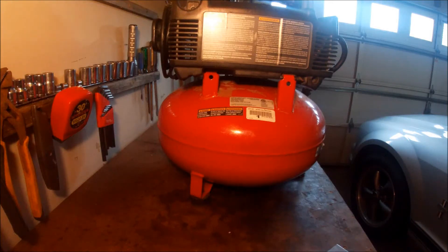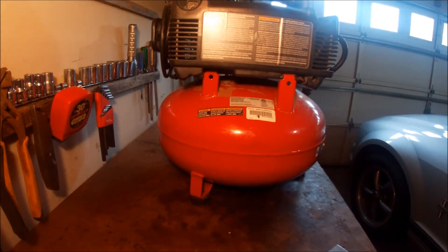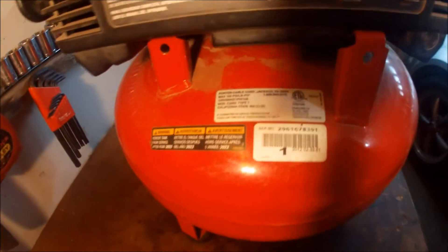What I've got here is a Porter Cable pancake compressor. It's a C2002 model type 7, and the problem I have with it is with the regulator. If you adjust the regulator, pressure will not adjust and it also leaks from the regulator. If you don't know what type you have, just look on the back at the label right here.